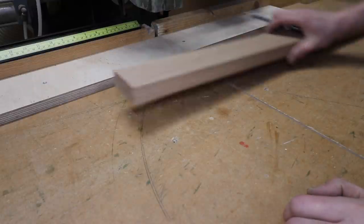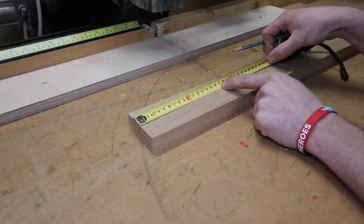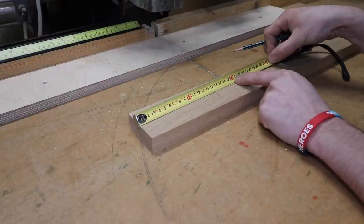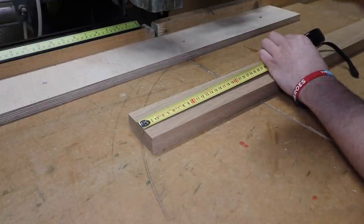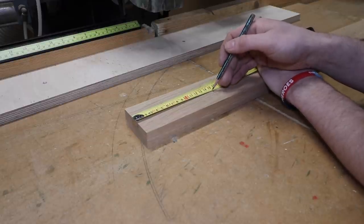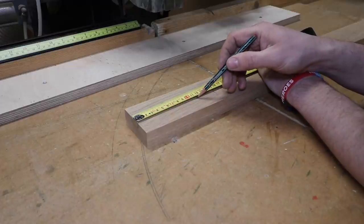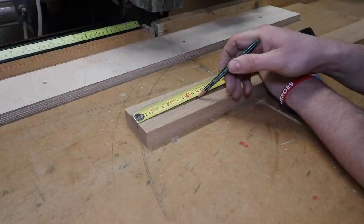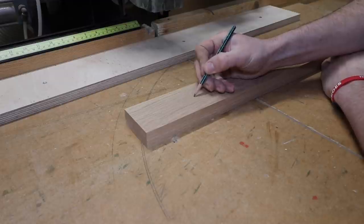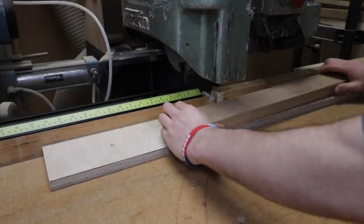up, and that will give us a shelf height to the bottom of the shelf of the 150 plus the thickness of your batten that runs between the shelf strips, plus the thickness of your shelf. So if you want the top surface of your bottom shelf to be 150, you're going to have to allow or remove from that figure the thickness of the shelf and the thickness of the battens that sit between the shelf strips that actually support the shelf itself, and that will be the start of your bottom cut. So let's make that first cut.